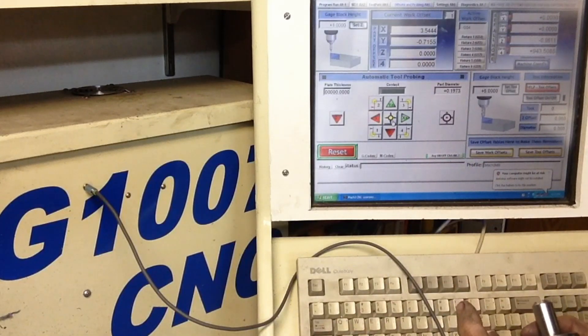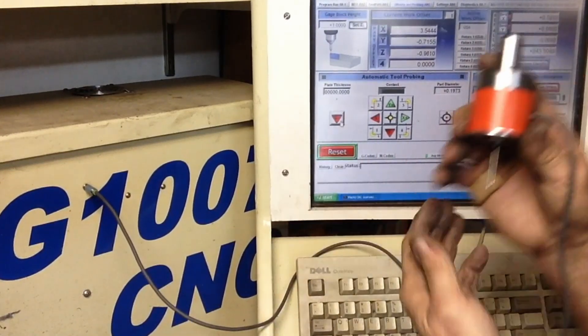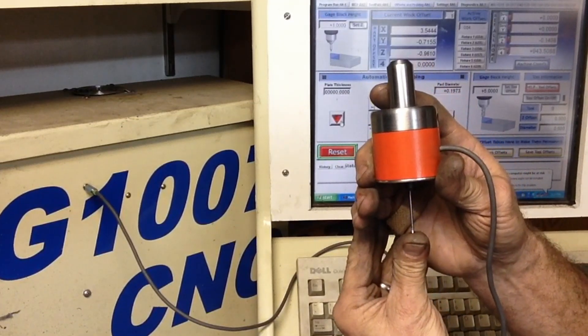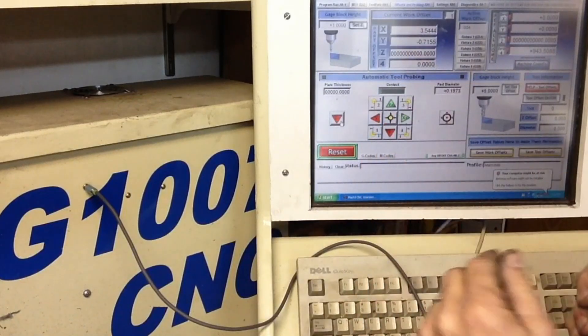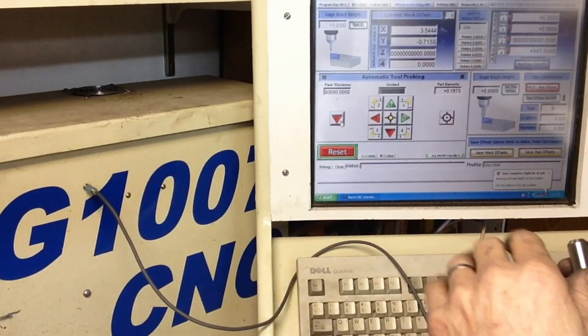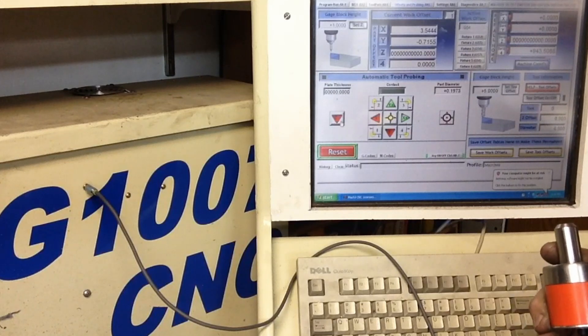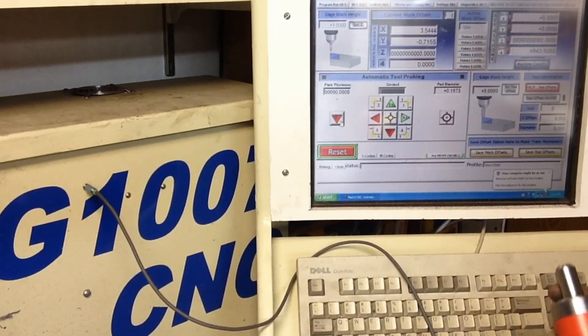Same way with probing outside — we're going to make it do what we want it to do. The probe works fine. Z-axis probing: as we start down, it contacts and there's where it stops. I'll amend that G-code so we do a retract back up — I want to make sure it zeroes first and then does a retract back above whatever that distance is. This screen set does need a little bit of work the more I play with it, but it's a good starting point.